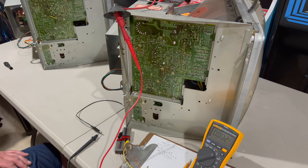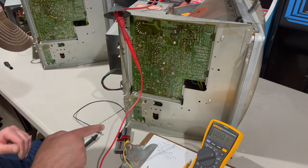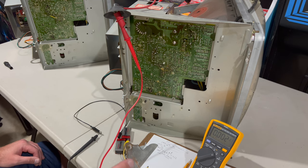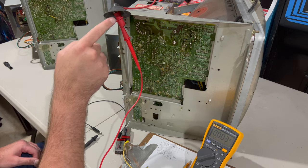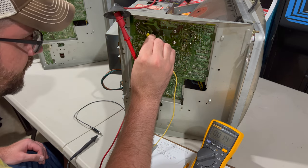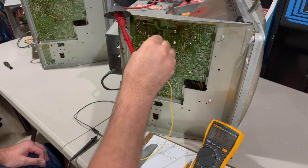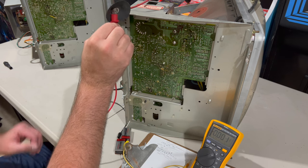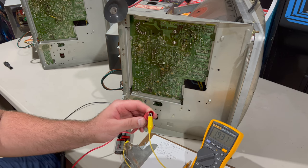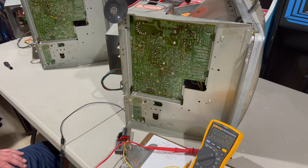The next step was to find the ground for the positive lead on the anode. Following the video I linked, I've got a couple of 9-volt batteries in series, a black alligator clip hooked up to the negative lead connected to the negative lead of my multimeter, and the positive lead of the multimeter connected to the anode. I've got the multimeter on DC volts, but no matter what, every single pin on the flyback horseshoe comes in around 3.8 volts, which I don't think is right. I think we're looking for something around 12 volts. I'm guessing this is something I unfortunately cannot do in circuit.